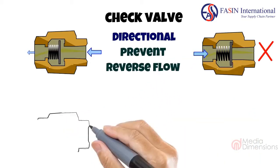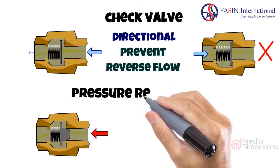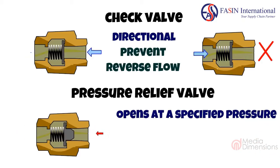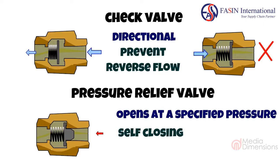There is another variation to check valves: if the check valve seal is extended, a check valve can be made into a pressure relief valve, where the valve opens and expels excess pressure build-up. The diagram shows a preset relief valve where the spring is designed and calibrated to reduce pressure build-up. The spring compresses until the seal is pushed past the sealing chamber, and then pressure is released until the spring overpowers the pressure and reseals the valve. These valves have saved lives by keeping operating pressure within a safe range. The best part about a relief valve is that failure occurs at the seal, and when that happens the relief valve simply prevents any pressure from building within the system — so a quick change and you are back up in operation.